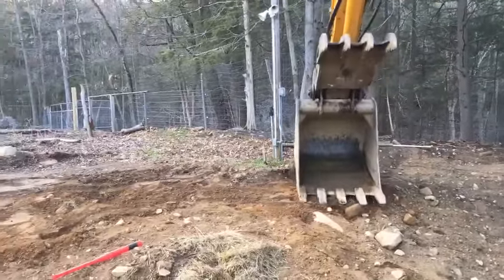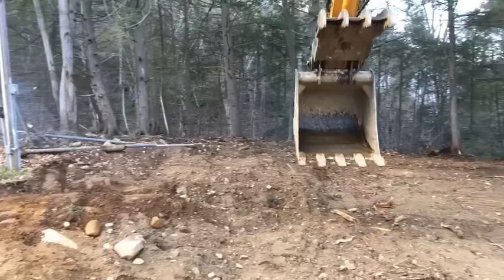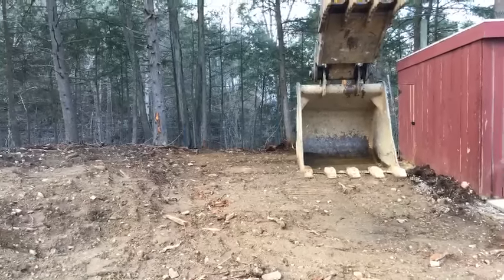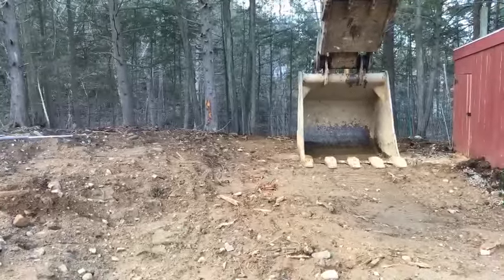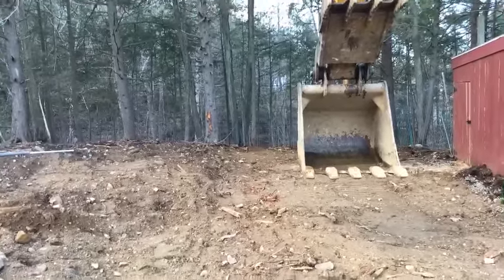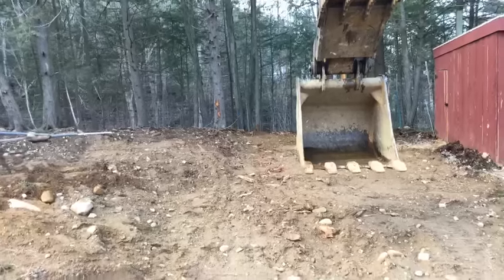If you want to put a road in like we did here, yeah, you need a much bigger machine — we had to dig like four feet down. It was four feet down and 15 to 16 feet wide. But if you're just doing trenching, installing a culvert, raising a driveway to a cabin — the mini can handle that. I'll get to all the comments when I'm done with this. If I miss one, I'll go through them at the end here.